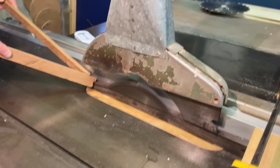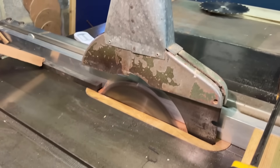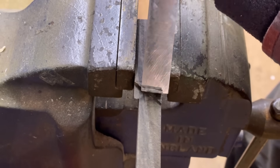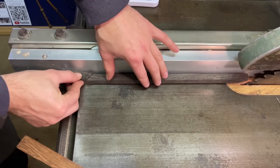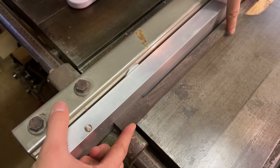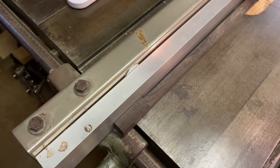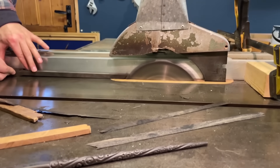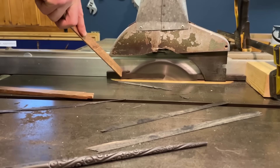Apologies for the wobbly footage — my table saw has been moved around a bit and I've been meaning to place it on a rubber membrane to see if that helps. I've got a stop block set up here so I don't cut the part that will fit into the chuck. For this last cut I need to chisel the bottom surface square so that the blank has support at both ends to go through the saw. Because the bottom part is perfectly square it registers against the fence really well. There's a little bit of deflection but I'm going to be super careful. And if you started typing 'just use a bandsaw' in the comments I suggest you stop, because my bandsaw isn't that accurate and doesn't leave a good finish, not to mention it's never had a throat plate.